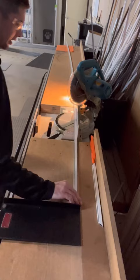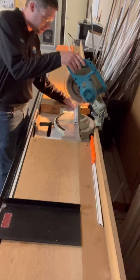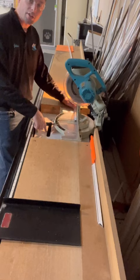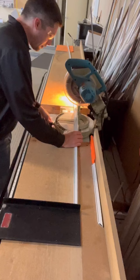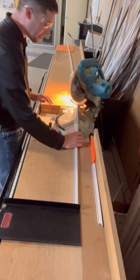I'm going to make sure my piece is all nice and clean, clear of debris. This one's got some damage on the end, so I'll cut that off and move this to zero. I have a trash can in this little hole so I can just throw my little piece in. Now I've got a nice clean piece. Go back to the 45-degree angle, make sure it butts up. Never put your hand on the danger side of the saw — stay on the safe side.